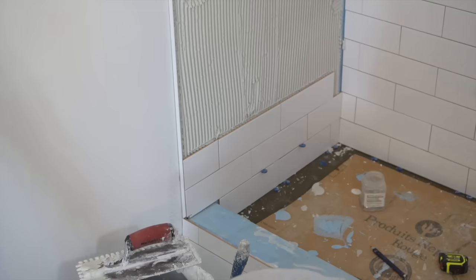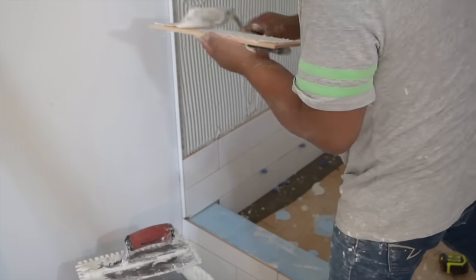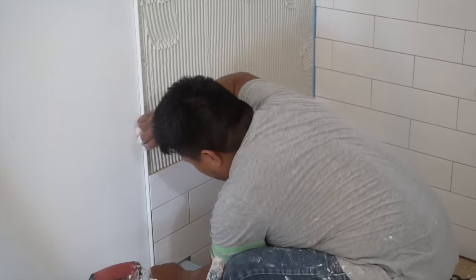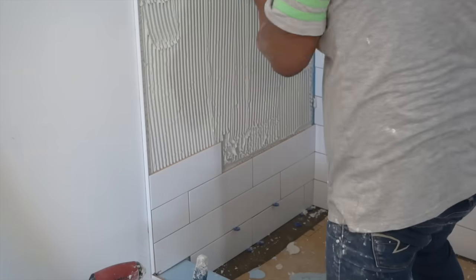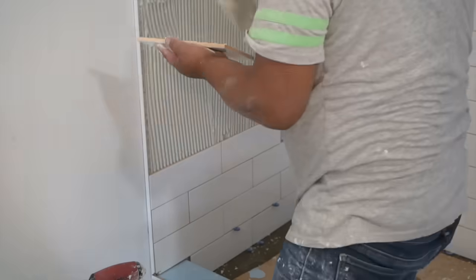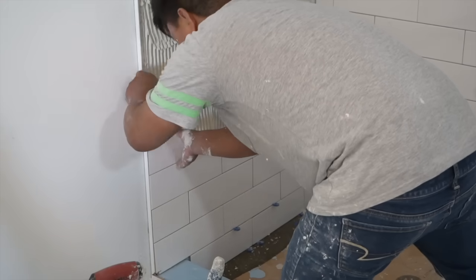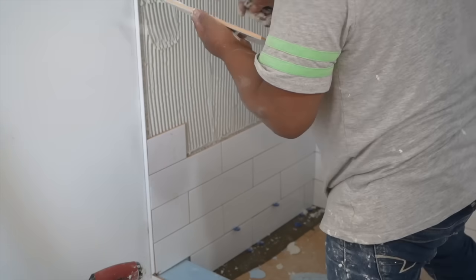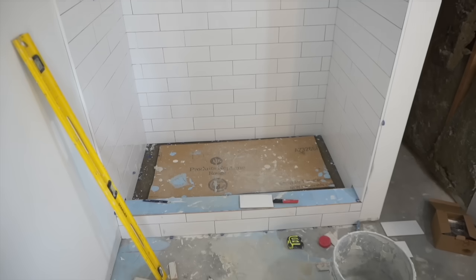And when you have that little beveled edge all the way around, once you lay the tile, that beveled edge creates the groove where your grout is going to go. So there's no need to add additional spacers and make that space larger. Eventually, if you do that, you get really thick grout lines. This way, it stays even and consistent, and your grout lines are nice and fine.